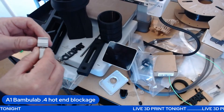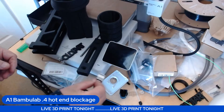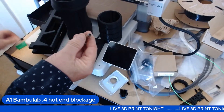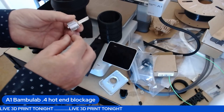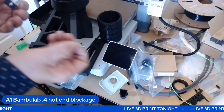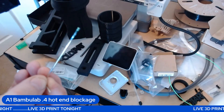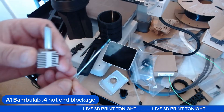So it's a bit of a rant today — please like, comment, and subscribe. Tell me what you've done to try and unblock these nozzles. I heated it up with a lighter till it was quite warm, put a 0.3 needle in the end to push the blockage back, then put an allen key down there. As you can see there's some green stuck in there and some black — the allen key went in and melted but because there was a bit of black in front of it, it just couldn't clear it.